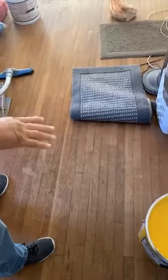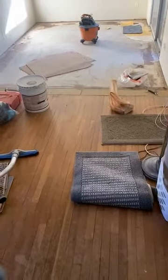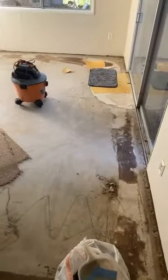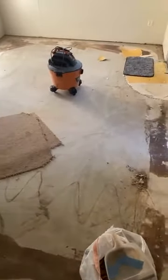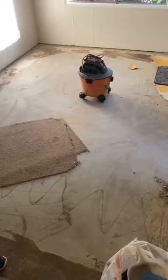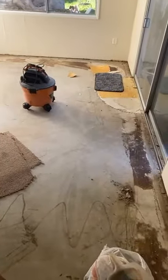Over here we're installing wood in this location as well, but down there is concrete. The section currently being nailed in is wood, but when we get to the concrete we're going to apply plywood first. On that floor, we'll be gluing down plywood using a glue that has a moisture barrier already within the system — when it sprays on, it acts as a moisture barrier so we don't need to add anything else. The plywood will be secured on top of the glue and then nailed directly into the concrete, which holds it nice and solid.